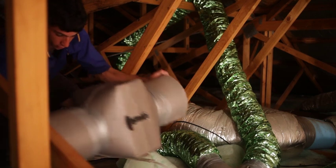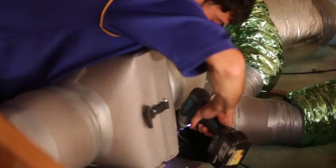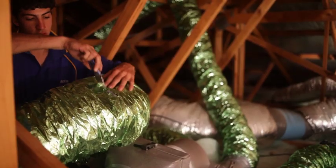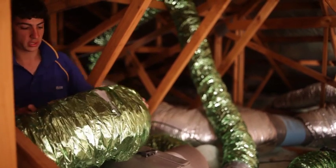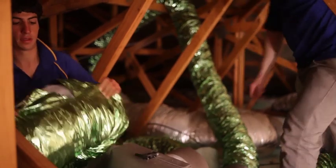Once the air handling kit components are lifted into the ceiling cavity, the first step is to secure and mount the fan and filter housing items in position. One good tip is to first of all mount a piece of plywood or craft wood in position on top of the rafters, and then the fan and filter housing can be bolted onto a firm platform.